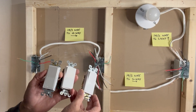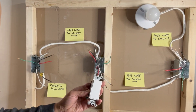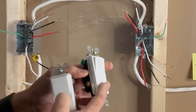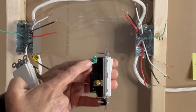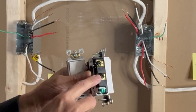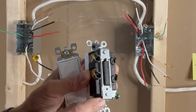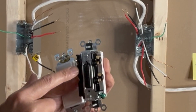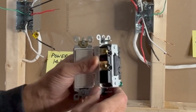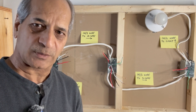For the purpose of this video, I will be using Leviton Decora style switches. These two are three-way switches and this one is a four-way switch. In a three-way switch, we have a black terminal and a brass terminal on one side, and a brass terminal and green grounding terminal on the other side. But in a four-way switch, we have two black terminals on one side and two brass terminals on the other side. If we look at the back side, the brass terminals are marked 'out' and the black terminals are marked 'in-in' — meaning we connect the incoming traveler wires to the black terminals and the outgoing traveler wires to the brass terminals. It's always good to read the markings and instructions included with the switches.